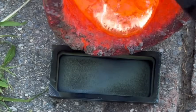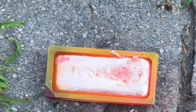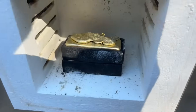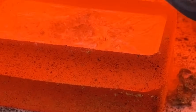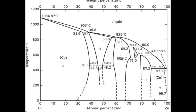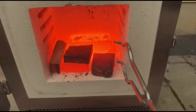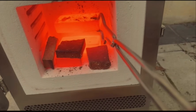So now let's get to processing these ingots. The first one was easy — it was air-cooled; all I had to do was pour it into a mold. For the second two, I stuck the ingots into the furnace and brought the temperature up to the melting point. Once both ingots were liquid, I brought the temperature down at about 1°C per minute. During this slow cool process, the dendrites are forming within the ingot. Based on their composition, I should expect these ingots to be completely solid at about 900°C. So at this temperature, I checked on the ingots and observed that they were in fact solid. At this point, dendrites are no longer forming.